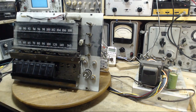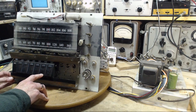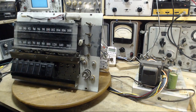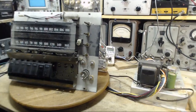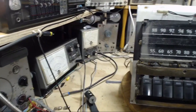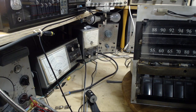This is with this off, so we should see nothing happening. Full voltage, 123. Okay, I'm switching on to AM. It's got a fair number of tubes. Will come on. Now I'm going to put on power. I've got, once again, the dim bulbs here. These are probably, well, we don't know what we're going to get. Maybe we're going to get a screaming hum, and that'll be the end of that. I can't remember how bad it was, but let's watch and see.